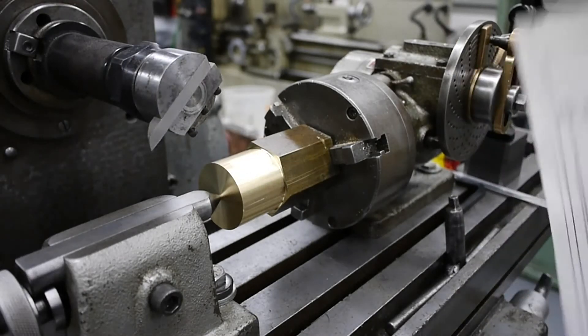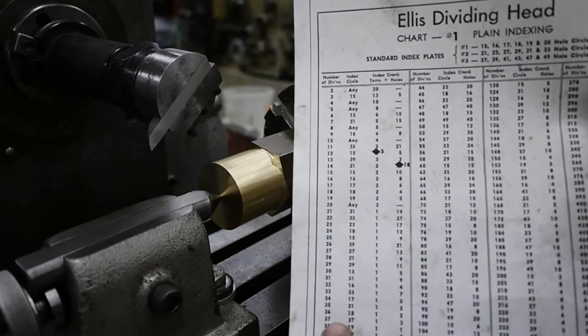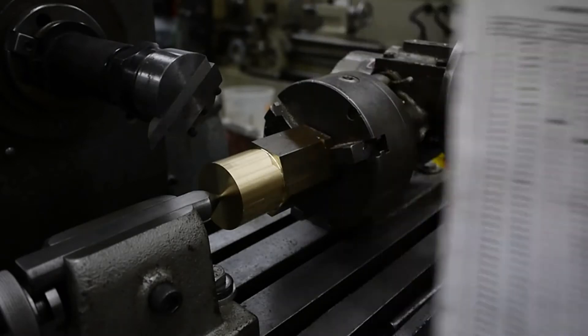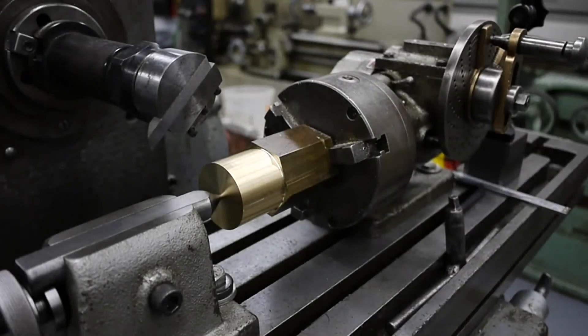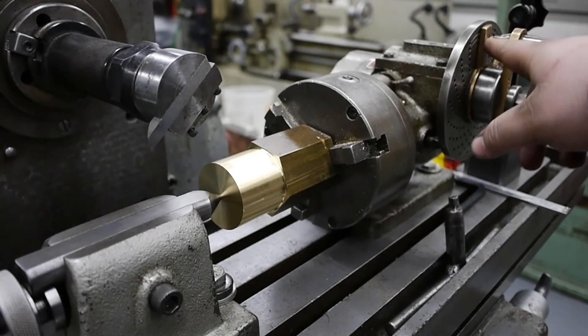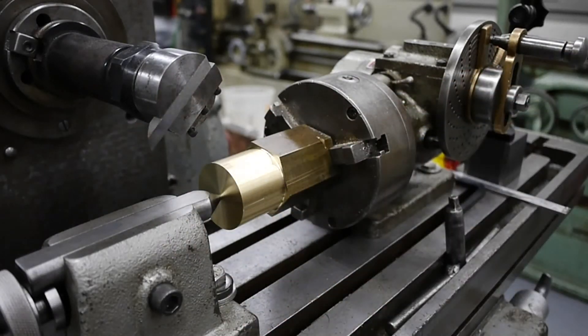Based on the Ellis dividing chart that came with the dividing head, for 36 teeth we need to be in plate number 18 with one rotation and two holes. We have that pattern set up on the machine right now. First thing is to set the depth — I'll set an indicator and take it in two passes: a 100 thousandths cut first, then a 72 thousandths cut on the second pass around.